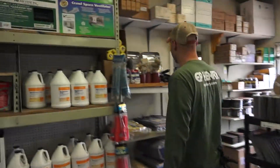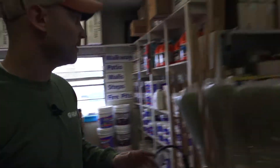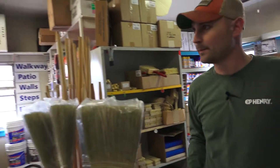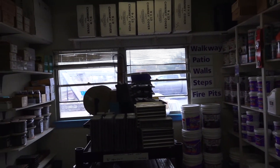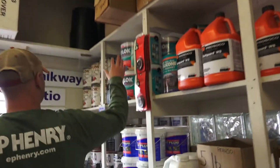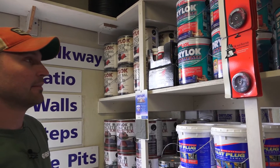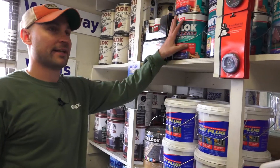You can also apply it with a brush or a hand roller — you'd want to use an actual brush, not a whitewash brush like these here. And then the fourth Drylok up there, just so no one gets confused: that one is a foundation block waterproofer. It's a white paint, good for foundations inside your basement, below grade — you just paint that on.